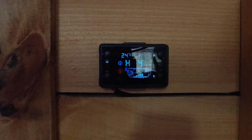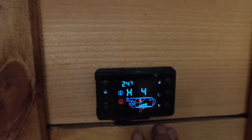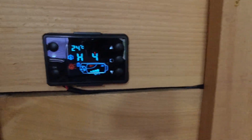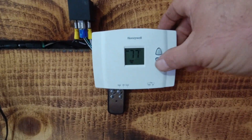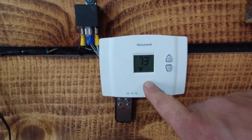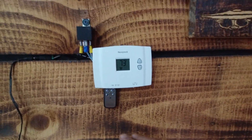You can see over here — make it brighter — the heater is running, doing its startup cycle. You can see the glow plug starting and the fan just came on. The heater was off and not running. Now that we have the temperature set at 73, we'll set it for 74. Now that the temperature is set above the temperature in here, the heater is running.